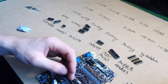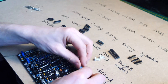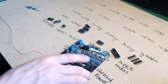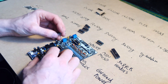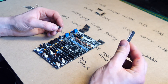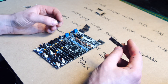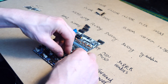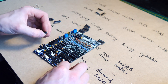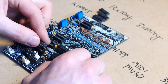Now use the electrolytic capacitors — these are all 10 microfarads. Make sure the white stripe matches up to the white marking, then pop in the trim pots, which are for calibrations later on. Then put the Molex connectors in using Blu-Tack to hold them in place rather than super glue, which can burn your eyes when soldering. Check the voltages to be safe, as you don't want to pop one of the chips.